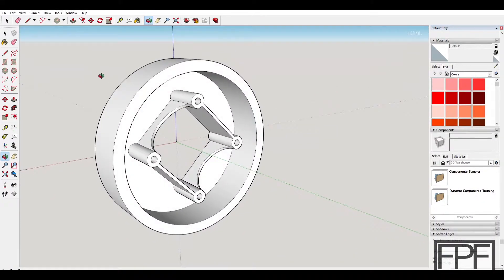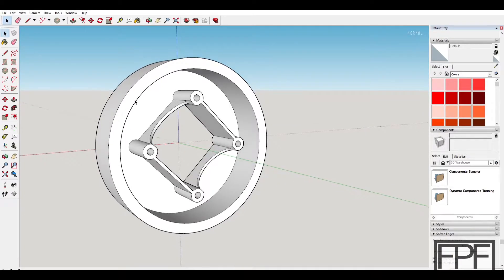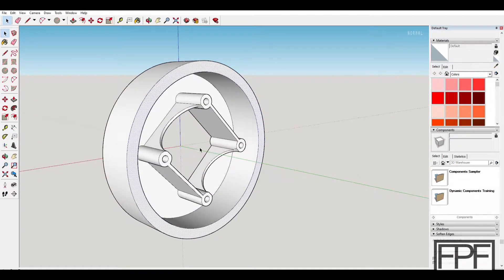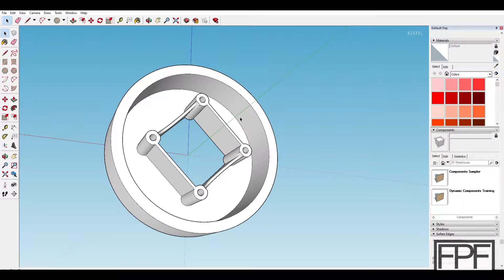And here is Mike's design. The way this works is the back portion of the camera — that plate that mounts on the wall or ceiling first — basically sits on this face here, and the four screw holes on the camera mounting plate align with these four screw holes here. So instead of using shorter screws to just attach the camera plate, you're going with a longer screw that sandwiches this all together. Your Ethernet cable comes up through the square section of the center and enters through either of the U-shapes on the sides. There's plenty of room inside this box, so your Cat5 could come through the center and you could have quite a bit of extra slack — if you're working up on a ladder, you could connect everything up, go back up and wrap everything around the sides and still fit it in place.